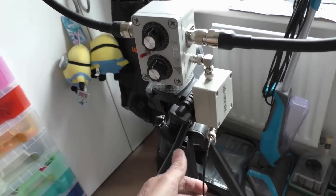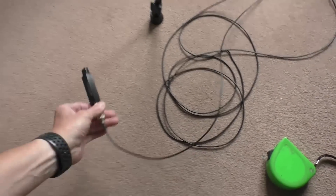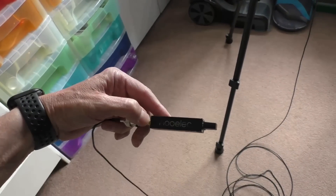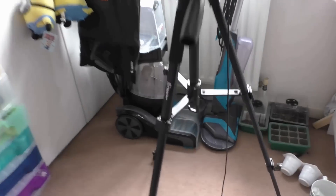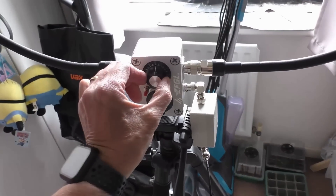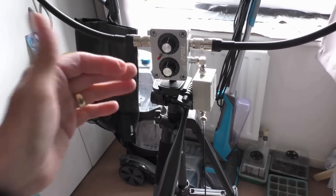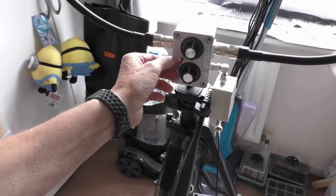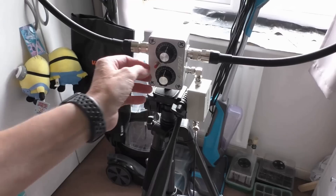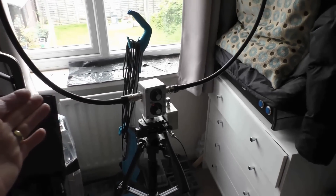The loop material has a corrugated, bendable plastic — you can straighten it out to get a perfect loop but I don't think you need to worry too much. I've fitted the supplied balun and you get five meters of RG174, which is extremely generous. I'll be using this just for a receive test connected to my NooElec dongle with an SMA converter. I've got to get a feel for the controls since I've never used one of these before. I'll do a receive test on the laptop and then later in the video I'll set this up in the garden and try to get a contact on it.